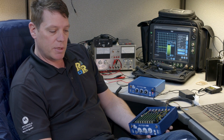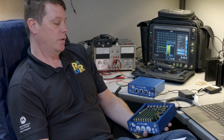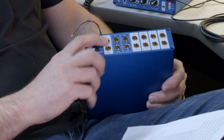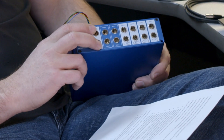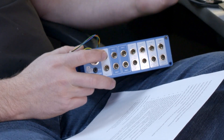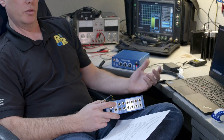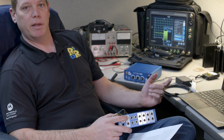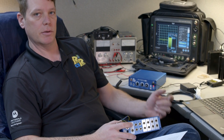This intercom will take up to one or two radios. You can plug radios into the back and operate up to two radios at the same time. So you can have some guys talking on the car channel and some on the crew channel, and there are even options for a two-button headset where one button talks to the car and one talks to the crew.